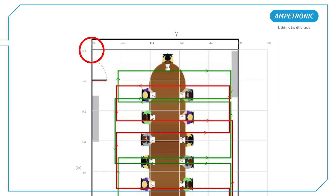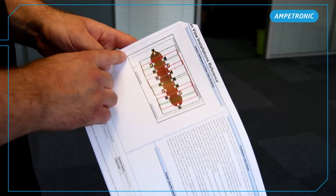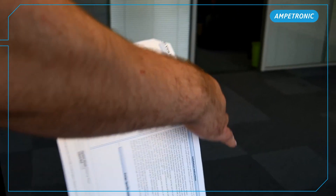These are the axes where all dimensions are then taken from. In this example, we can see the door on the drawing, so we can work out that the drawing should orientate with the 0,0 point in the corner near the entrance.